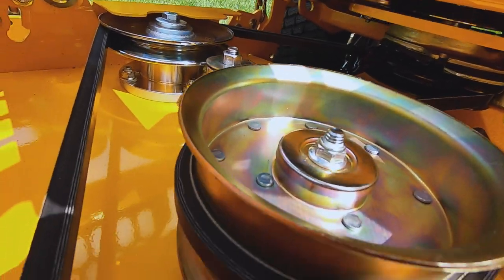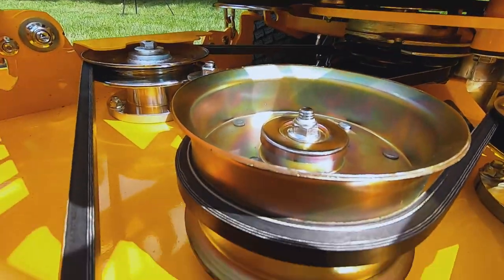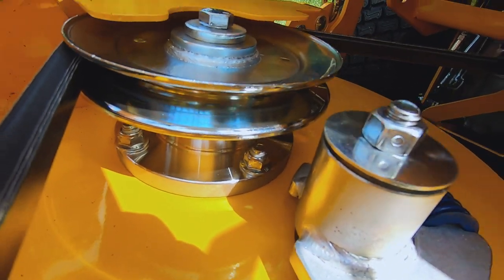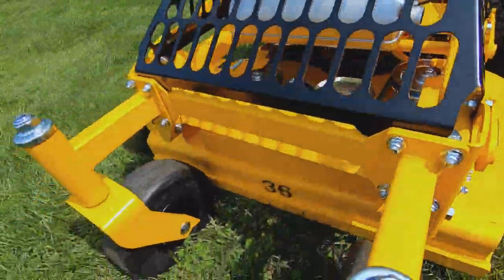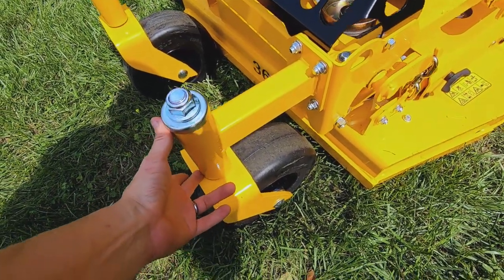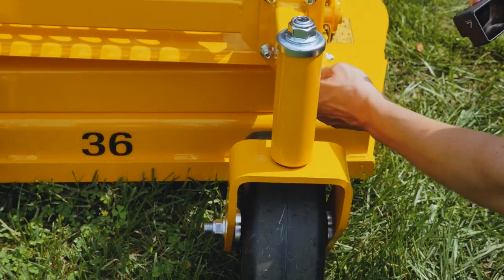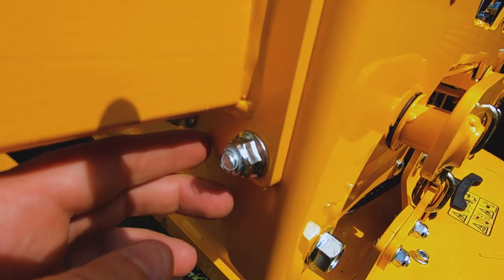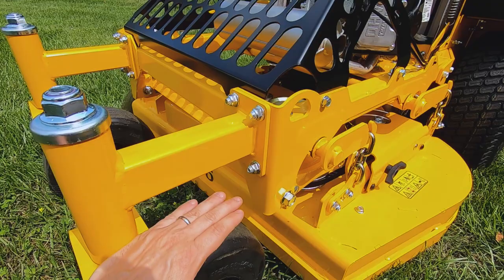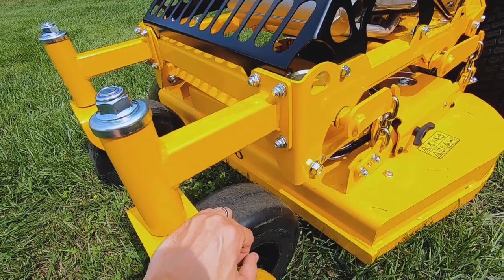We try to avoid making our belts too tight — you can see this is nice and soft, that's how it should be. The spindles on the B series are an aluminum housing; on our other machines they're cast iron. The small B has a bushing setup — it's real long so there isn't too much force on them. A little trick: there's a small notch in the bottom of the arm. If you flip the arm over, you can lower the front end of the machine about a quarter inch. So although the height selector says two inches, you can configure the machine to go just a little bit lower.